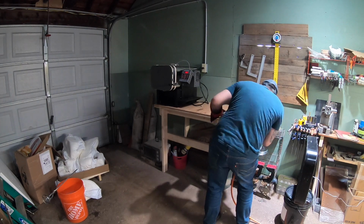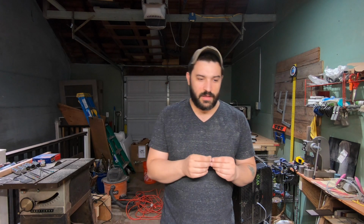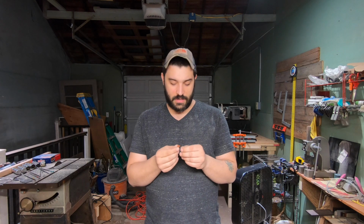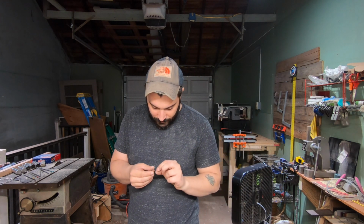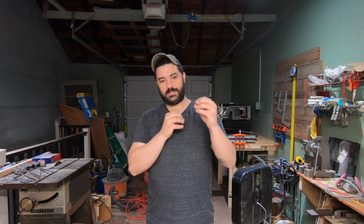I can show a picture if I have one, this Ceram guard. It goes on like a ceramic coating, basically for protecting steel. When it goes in the oven, it heats up, bakes, and turns red. You can see on the inside that black spot is where decarb happened. The knife expanded due to thermal expansion, and I didn't account for that. So the Ceram guard cracked and allowed air to get in, and oxygen and carbon form oxidation, which is a decarb.